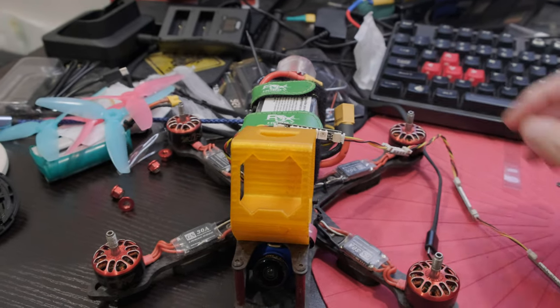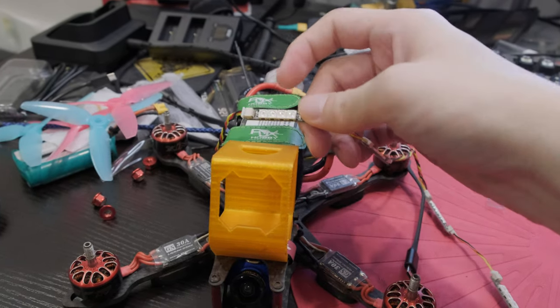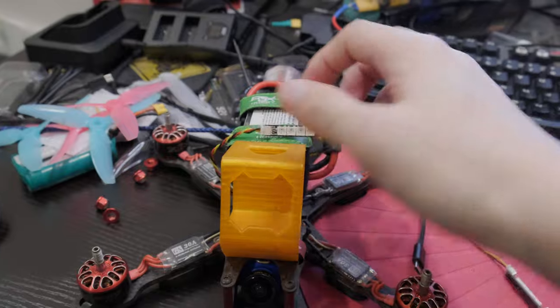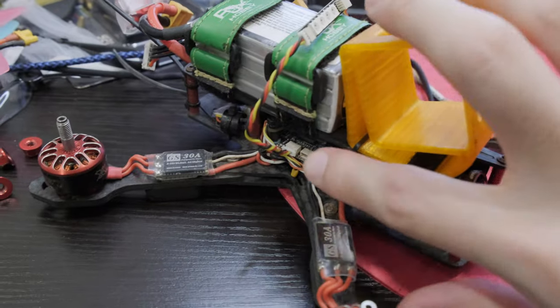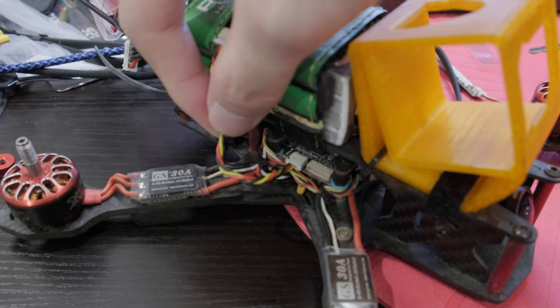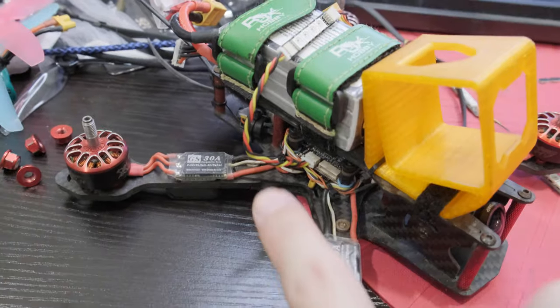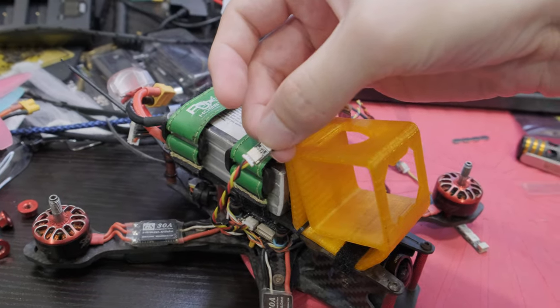Next is the drone. In the video, RAND has two of those super high brightness LED video lights. But in my test, just the flashlight from my phone seems to do the job. So, what I have here is a string of addressable LEDs. They are actually individually addressable, which means that you can change the color of each of them individually. They are connected to my JHE MCU F7 flight controller. We have a handy little connector that is already on there, so I just have to modify it from 4-pin to the 3-pin that this LED module accepts.